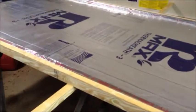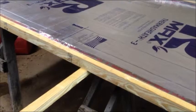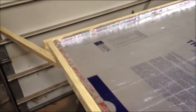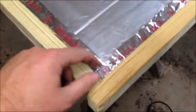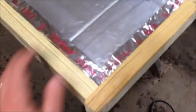Here's what it looks like with a treated frame around it. These are just 2x4s that are ripped down on a table saw to 1x2s. The top part is going to be the full width, and then the bottom will be in between the side runners. I just got to trim these up a little on the ends and then it'll be time to tape the back side. I'm going to put angle brackets in on all four corners, then tape the back side, and then we'll be ready to spray paint this black.